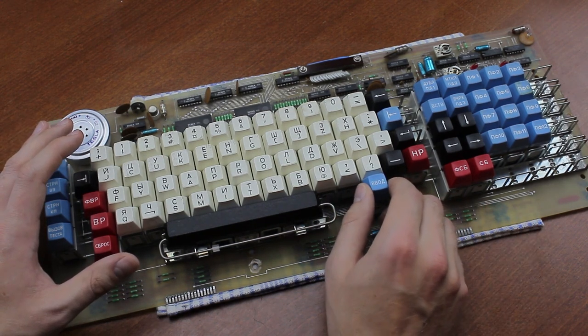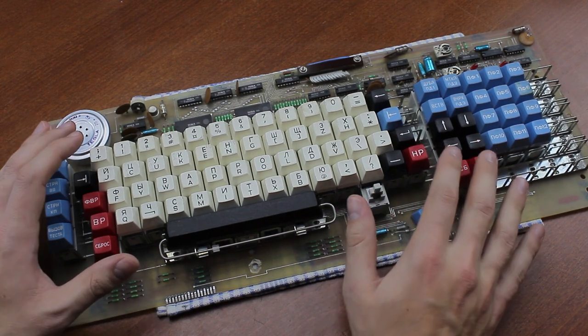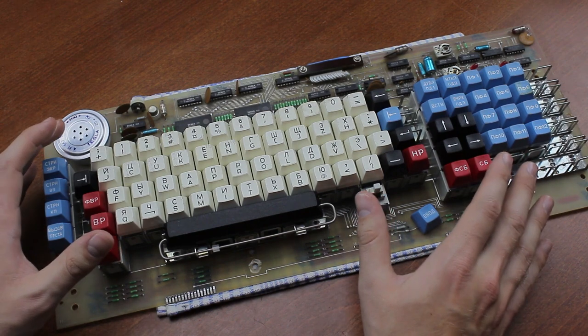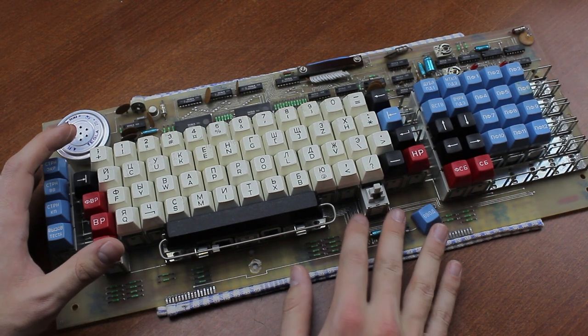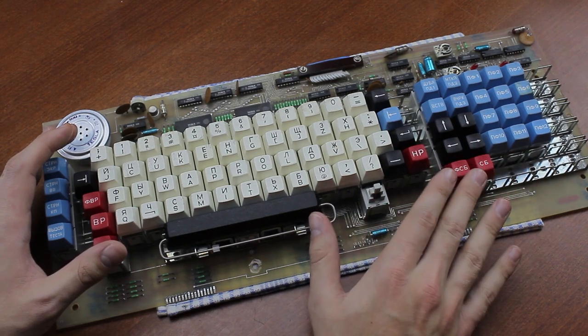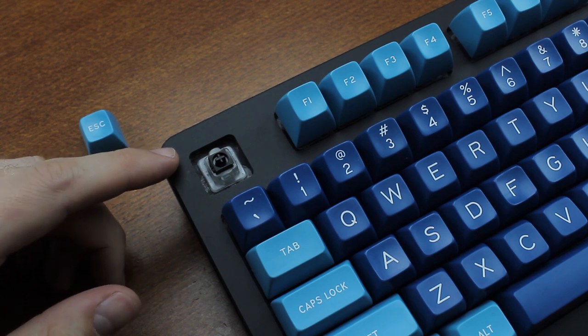In particular, those from Tesla were more or less direct rip-offs from Honeywell's designs. This console series keyboard, produced by Česká zbrojovka for the Russian export market, possibly the Red Army, uses Tesla switches that are very close in design to Honeywell dual magnet switches, except these are even more over-engineered and use four magnets instead. The advantages of Hall effect switches have inspired modern adaptations as well.